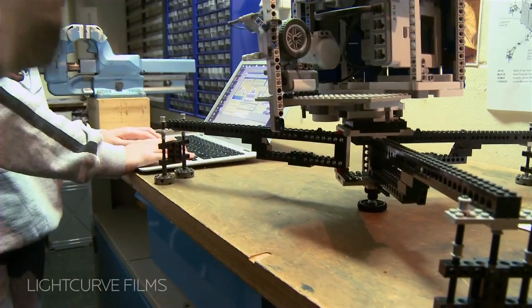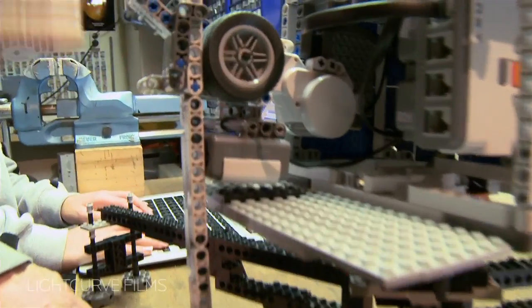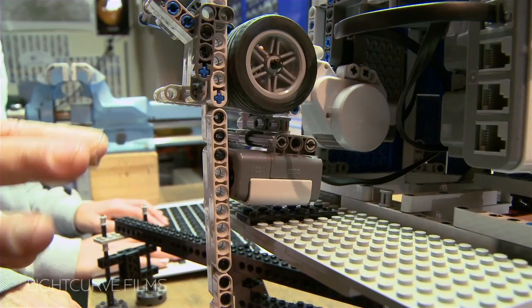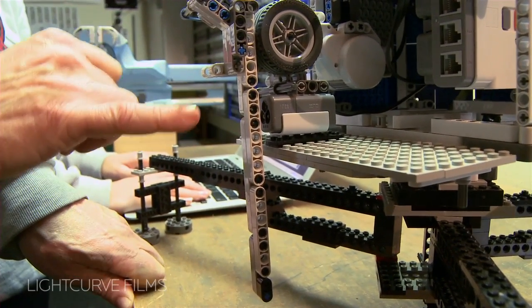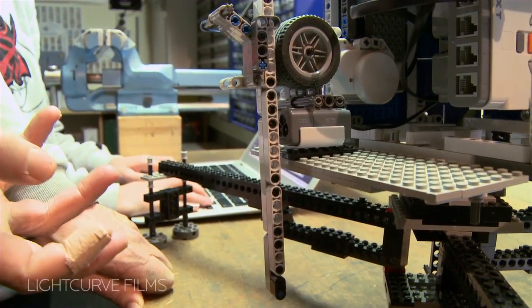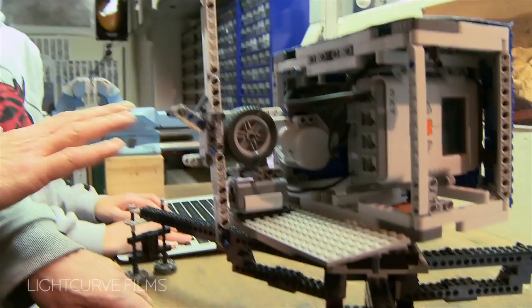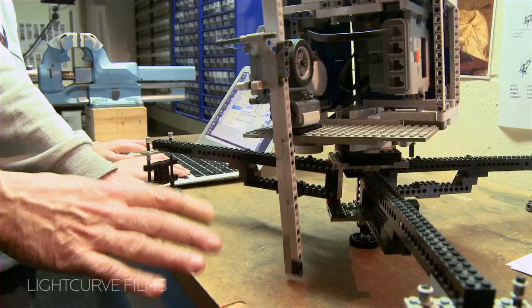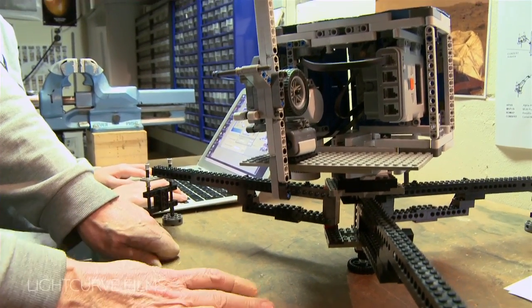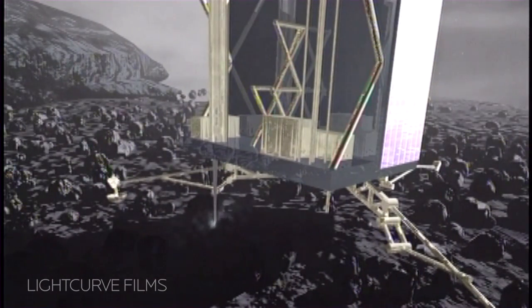This surface is not really soft. If you just go down, you see that this rubber wheel here just turns loose and the thing stops — so we don't break anything in the mechanics and we don't damage the motor. We want to use this little sensor to find out that the device has really stopped and doesn't move anymore. If it stops too early, we command it to go back up to its parking position, then turn a little bit and try again. We do this until we find a soft spot, so if I drill a hole and fill it with sand, we get a nice demonstration of this concept of autonomy.